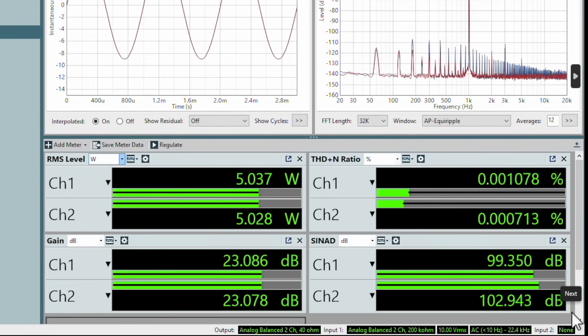The go-to reference in the past couple of years has been SINAD — signal-to-noise and distortion — and amplifiers with really high SINAD, say 100 dB, get propped up as the greatest thing since sliced bread, but most of them do maybe 100 watts and many are very load dependent. Don't forget that this McIntosh also has very good SINAD scores of about 100 dB at 5 watts into an 8-ohm driven load, but it also has the capability to deliver 500 watts or more. It's not a small amp chasing a SINAD number at 50 to 100 watts.